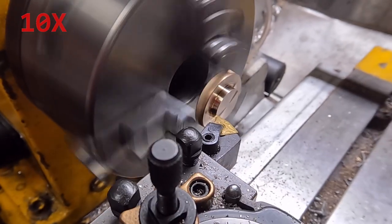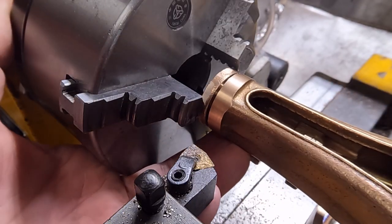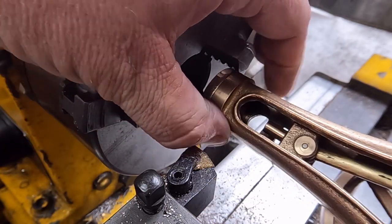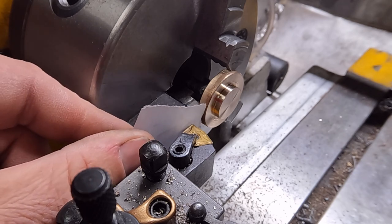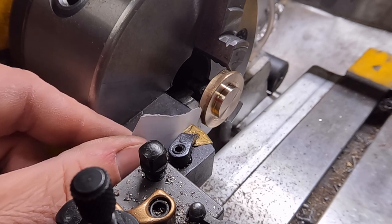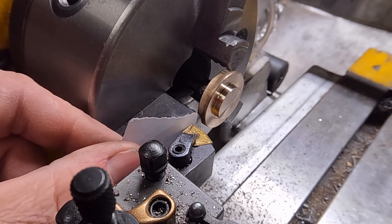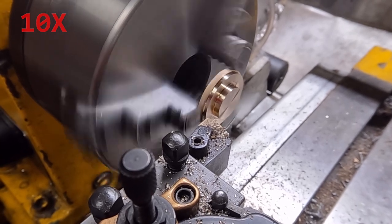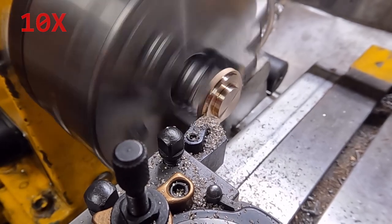We get that till it fits inside the inner bore. The cylinder head actually sits inside the shoulder, so next we have to take down the outer diameter to the diameter of the inside of the shoulder with a little clearance. There's very little room here, so I'm making sure I'm a paper width away — that's where I'm setting my zero on my DRO — so I won't chip the chuck. I'll feed in manually and be very careful not to exceed that. This should turn down the necessary thickness for the final part and complete the machining for this side.